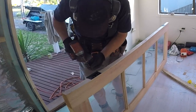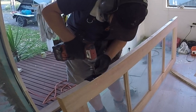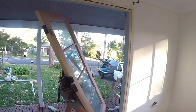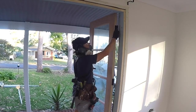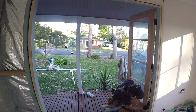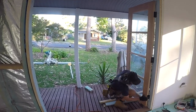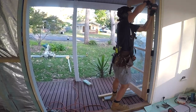For these external French doors, I will be using three hinges per door. I always install the door without the handles first. This door will represent the closing jamb for the second French door. To help with the install, I use timber blocks placed at the correct height to hold the door into position while I screw the hinges off. The latched side door I'm installing will be predominantly closed, whilst the opposite door with the handle will be used for regular access to the house.